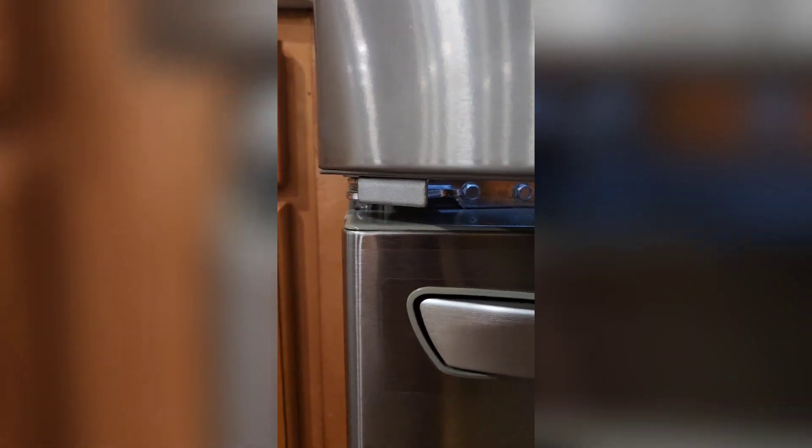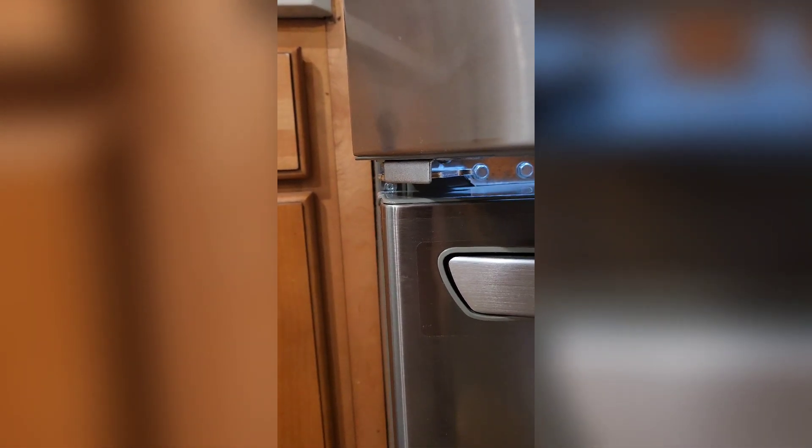As you see, when you open the door, it doesn't fall back in any way. This is open all the way — it doesn't come back over here. If the hinges were on this side, it would need all that clearance, but since the hinges are on the inside, the door opens up. From here looking straight, that's about maybe three quarters of an inch to an inch of clearance that's needed.